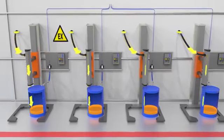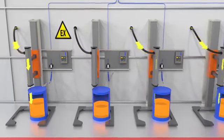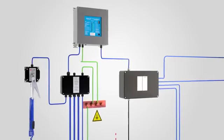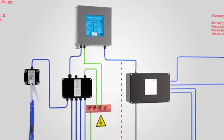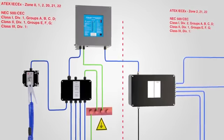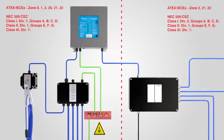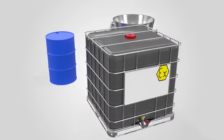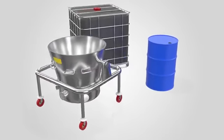The interlocking contacts may also control valves and pumps to prevent the flow of product should a reliable grounding connection be lost during a product transfer or mixing operation. The Earthrite MultiPoint monitoring unit, power supply and associated equipment can also be installed directly within the hazardous location, allowing the installation of equipment to be tailor-fitted around the process. This solution can be applied for various containers and movable items such as conductive drums, IBCs, pump carts and totes.